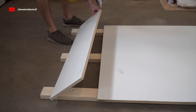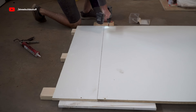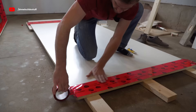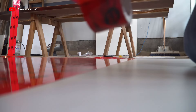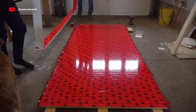Now I'm just setting up the base of our mold. Again we're over eight feet so I'm just adding on a little piece at the end with some silicone and strapping it on with some scrap pieces of wood. This isn't 100% necessary if you use mold release, but I didn't have any so I'm sealing the entire mold with tuck tape — or if you're in the US, I think it's called Tyvek tape. It's just house sheathing tape that the epoxy doesn't stick to. Then I'm applying some silicone to the walls of the mold and setting it onto the base.